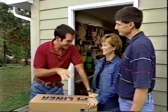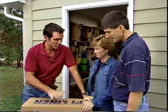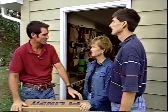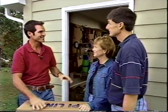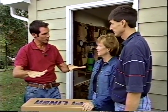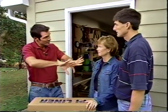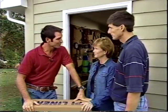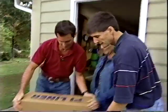Mark, Jenny, today's the day you've been waiting for. All right. This is your pool liner, and it's a vinyl pool liner, so it was a really good idea to keep it inside because it's a soft material, so obviously the warmer you can keep it, the easier it is to work with. But the steps that we're going to do now, we're going to need a little help because it's heavy. We're going to spread this out over the pool, lower it down into the pool. We'll actually take the air out from underneath it to get a nice suction all the way around, make it good and tight, and then we're going to fill it up with water. All right, we've got a few steps first, but let's get this over there. Okay, let's do it.